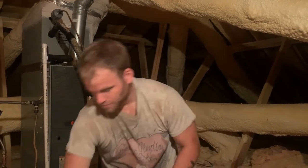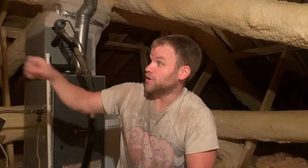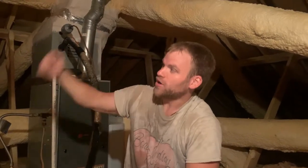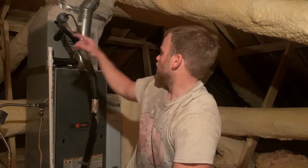Anything done properly and efficiently, and especially with spray foam — this was done very, very well, I'm really impressed. They did a pre-test to see how leaky his ducts were and it was over 30% leakage. So of course when you spray foam over that it goes to zero. In dollar terms, for every dollar he was spending on his HVAC bill he was losing 30 cents. They retested the ducts after spray foaming and it's essentially zero, or very little leaking through his furnace and plenum areas.